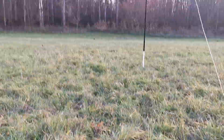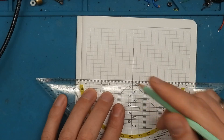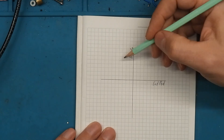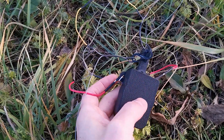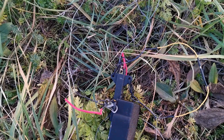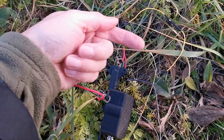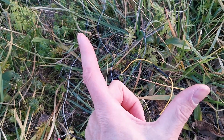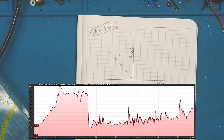Both antennas were stretched over the same mast, but at a 90-degree angle to each other. This was so that they would not interfere a lot with each other. They both have more or less the same height in the center and are on the same position in the field. At home I 3D-printed a mounting system. The end-fed goes some centimeters over the dipole, but 90 degrees to it. The target was my station at home, 38 kilometers away, no direct line of sight.